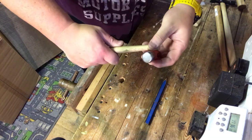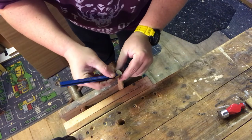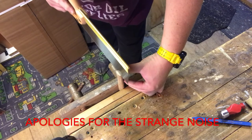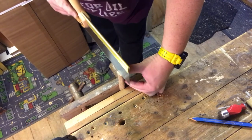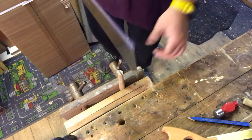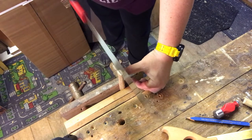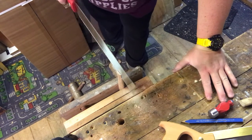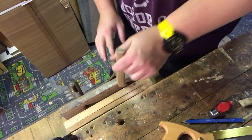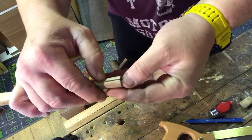So that's going to be a small little hammer. With that on the end that should be fine — perfect for small amounts of work. We're going to cut it down the length. That's making a lot of noise and might be shaking the camera too much, so let's try the old pull saw instead and see if that's any easier. I've never put a new handle on a hammer before so I don't know how far to go down. We've got about 15mm — that should be alright.